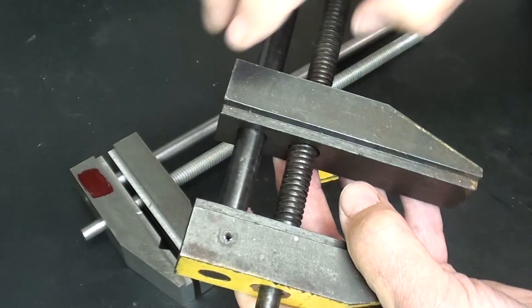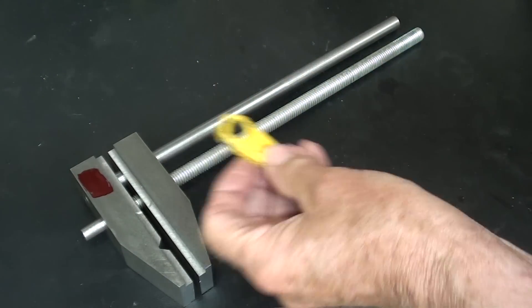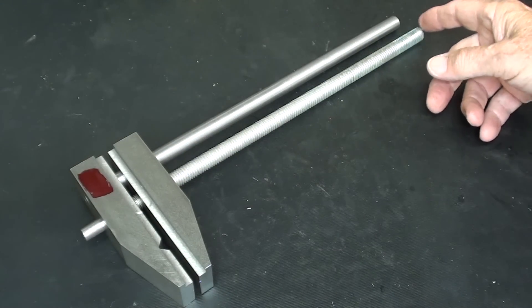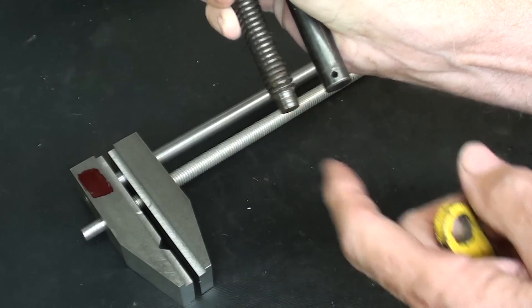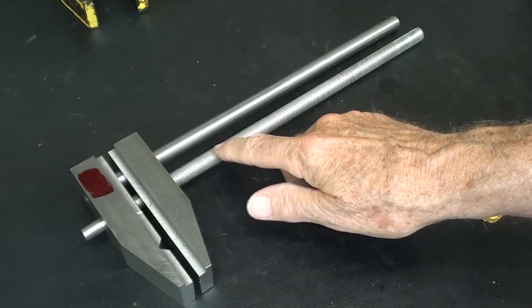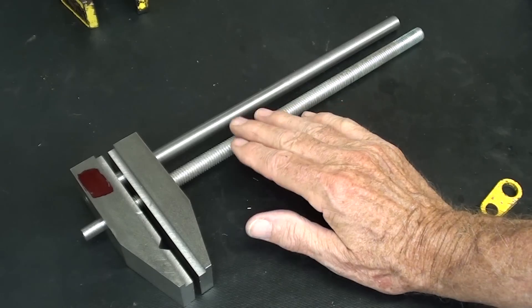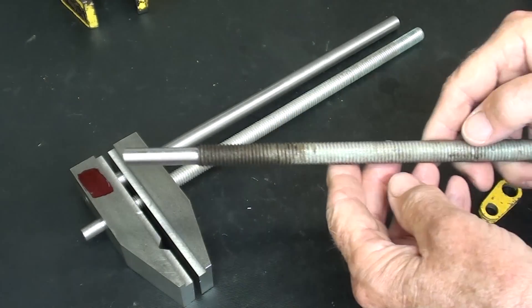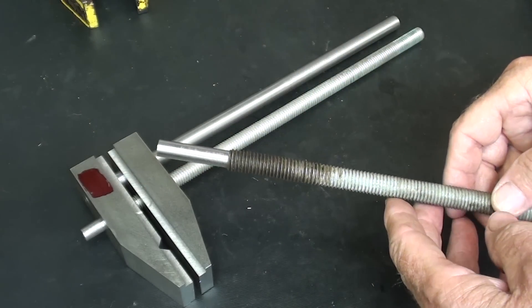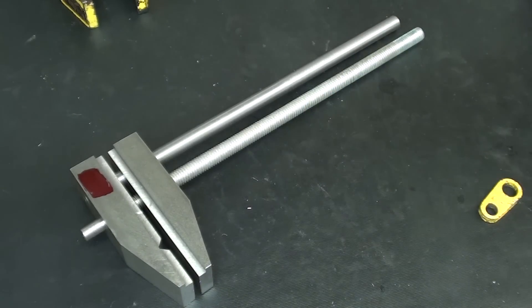In this chapter, I'd like to drill the hole right here that will hold the guide rod in place, and then make this spacer, which goes on here, which also means I need to shorten this threaded rod just a little bit and turn the end down something like this. In regards to this threaded rod, I would much have preferred threaded rod that was not plated. I really don't like that look at all, but it's certainly better than this garbled up piece I had in my scrap bin. You really can't buy unplated rod at your local box store — maybe from McMaster Carr.